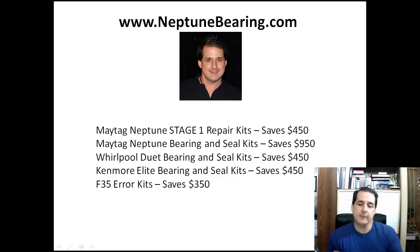And they have to have that information for the new washers because they try to determine how much clothes you have in there and how heavy they are. Are they jeans? Are they sheets? Are they towels? Towels and jeans are really heavy. So when they fill up the machine, they fill up for a certain cycle, and the APS will go from 0.38 volt on an empty tub to about 0.7 on that first fill cycle. Then they can tell how much water is absorbed in the clothes. Towels are going to absorb a lot of water, so it's not going to show up on the pressure sensor as much.